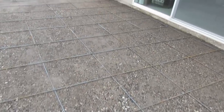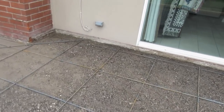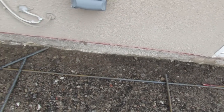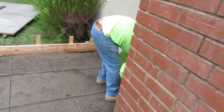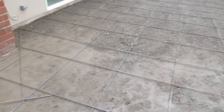There's a setup there, easy breezy. It's rebarred up. We don't put adobes in it because you just trip on them, and it could be too high. If you get it a little bit too high, an inch from the top, the rebar will crack it. So I'd rather just lift it as I go. I bring a guy specifically, that's his only job, is to pull a hose and lift the rebar, you know.